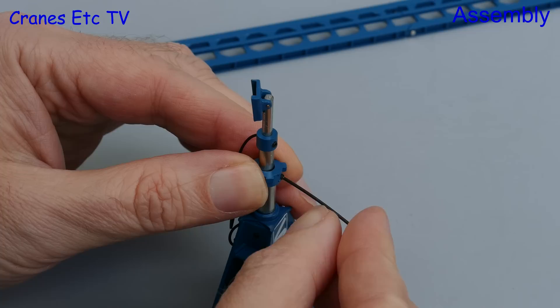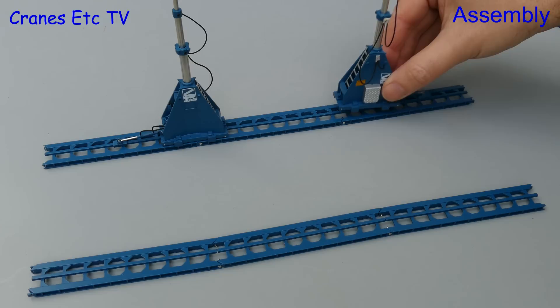In fact they were all released by putting some lateral pressure on the Allen key as you turn it. That seemed to make the key grip the screw better and that meant it could be unscrewed. We will now move on having set the height of the rams to be the same on each of the units.